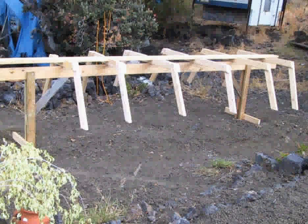Next, those ribs are put on a strong back jig. This is just a very simple stand that holds them up and positions them correctly to build the boat. Onto those frames is attached a timber called a keelson. It fits into slots that you've pre-cut into the frames — also a standard piece of lumber you can buy right at Home Depot, Lowe's, or any lumber yard.